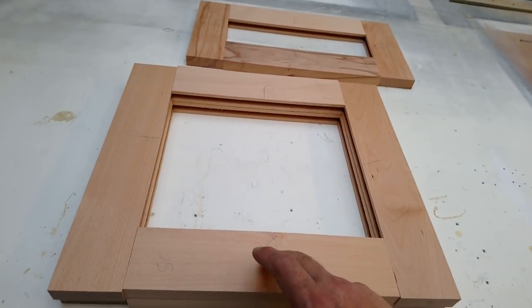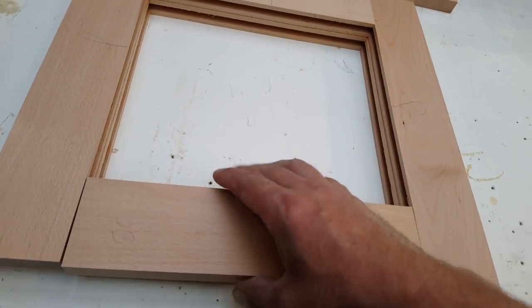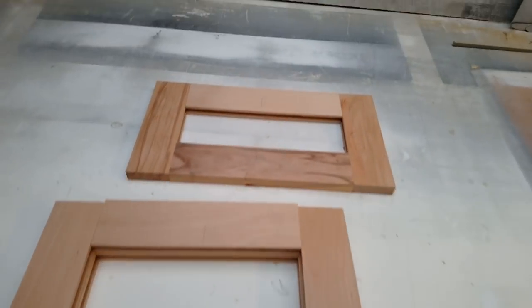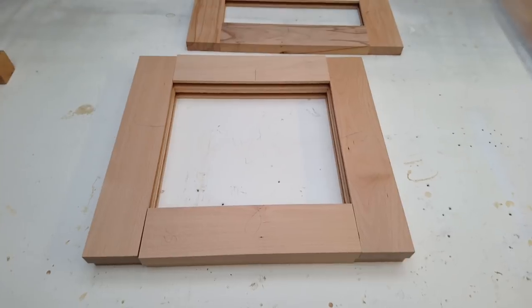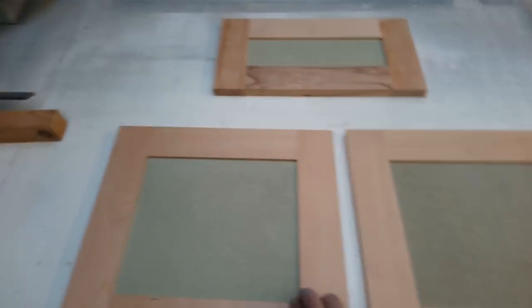One of the doors is 2mm bigger than the other, so that's 78, that's 80. So I labelled those, so they're all the same. The other one's obviously B and B, and then that one's on its own, so didn't need to label that one so much. I cut the panels a fraction short of 10mm. Alright, I'll glue them up later when I've got my clamps. I've got loads of clamps, but they're all too big.